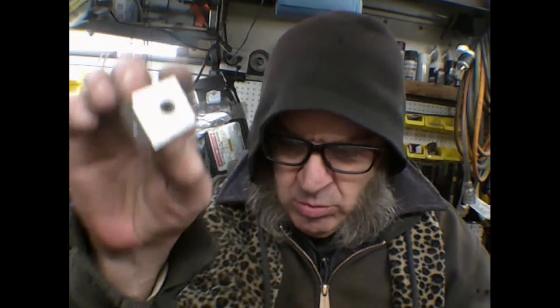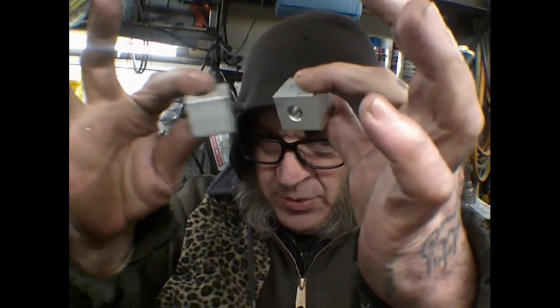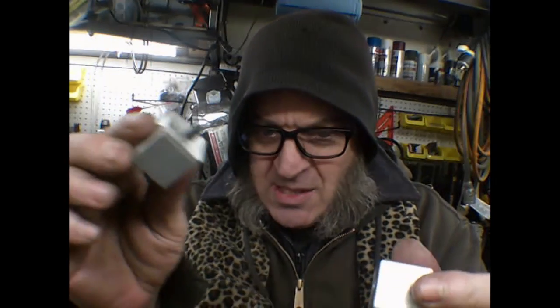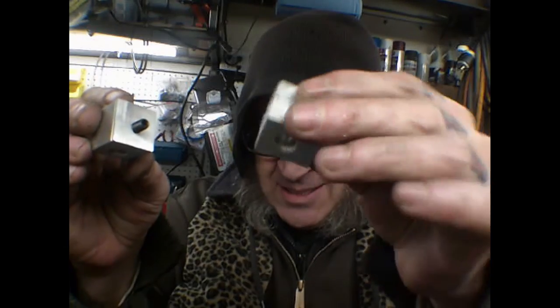Just tapped another portion of this - I got it on both ends tapped. This is the best solution I could come up with to get this thing to do what I want. Some Loctite on one end is going to be in order. That's going to fit okay, and that's going to give me the rotation I was looking for. So I'm going to Loctite this in - that's going to allow this one, in theory, to rotate a little bit. It only needs to rotate like five degrees, but it needs to rotate that five degrees. A little bit of red Loctite.